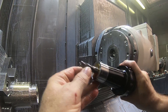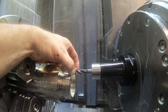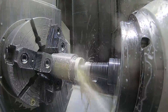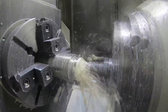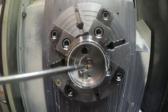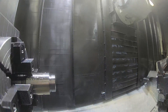Here's the second half inch roughing end mill — the short one. It's going to go in and finish. There's a bore in the end of the part that's 1.1 inches in diameter finished size. This is going to rough that in — it goes another one inch deeper than the bottom of the counterbore. It also has some features that are the corners of the pocket below it in the sides of the bore, so you can't just bore it in there; you have to kind of mill it. See those two bumps in the bore there, and the two little gun drill holes that are going to form the corners of the pocket, and the half inch hole in the middle which now I can come in and finish to depth.